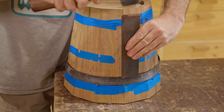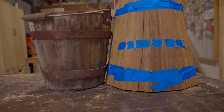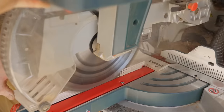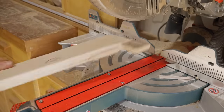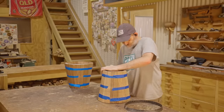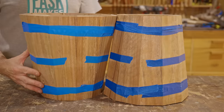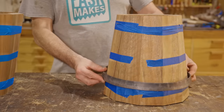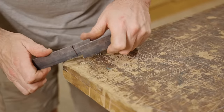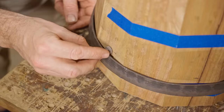This is where everything started to go wrong — the rings wouldn't wedge onto the bucket. The sides have a bit too much angle even though they're the same as the original bucket, which worked out okay. Anyway, I'll make adjustments to the jigs, re-cut the staves, and lessen the angle of the sides of the bucket. That seems better even though the difference in angle isn't much at all. Now the ring is too big though, so I'll adjust that off camera. While marking where to make the second cut I'll explain the other method of joining the ring ends: you could overlap the ends by around an inch, drill a hole through, and bolt it together, then grind the bolt head down much thinner — positioned in the center of a stave there'll be enough room for it behind the ring.